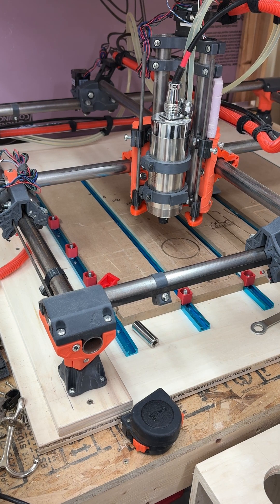Overall, this is quick and simple — I think it cost me about $15. I did buy two different nuts for it: a brass nut and a synthetic nut. I ended up going with the brass nut. I had a synthetic nut on it previously, and when I was looking at it there was a reasonable amount of wear on that nut — probably from the weight of the spindle versus something like a 3D printer. I swapped that out to a brass nut and lubricated the lead screw with Super Lube. This is one of those things I probably should have done long ago and it looks to be working well. I'll get that spindle mount reprinted and we'll get back to work. Thanks for your time.